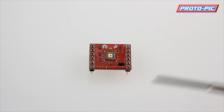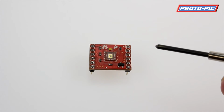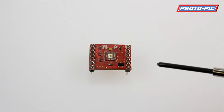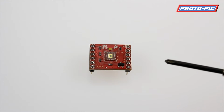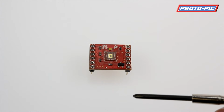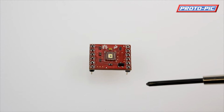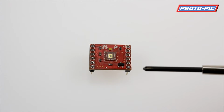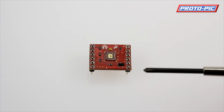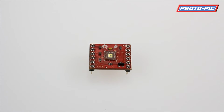Now, hooking this up to an Arduino is relatively easy. You have a few inputs for power, 5 volts and ground. Then you have output of red, green and blue. They're on a 3 volt swinging voltage, so it's 0 volts up to 3 volts. And you also have the lines for the amplification value. These are normally pulled to ground for a normal level, and the code that's supplied on our website actually pulls these lines down to 0, so there's no amplification on those. So we'll get this onto a breadboard and hook it up.